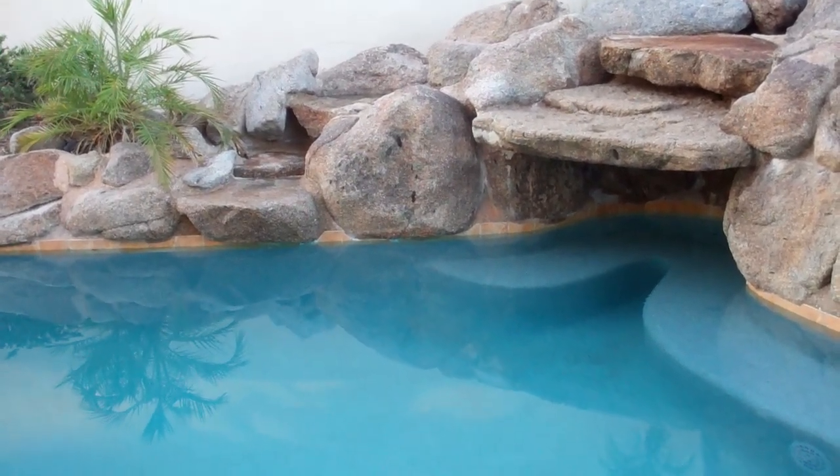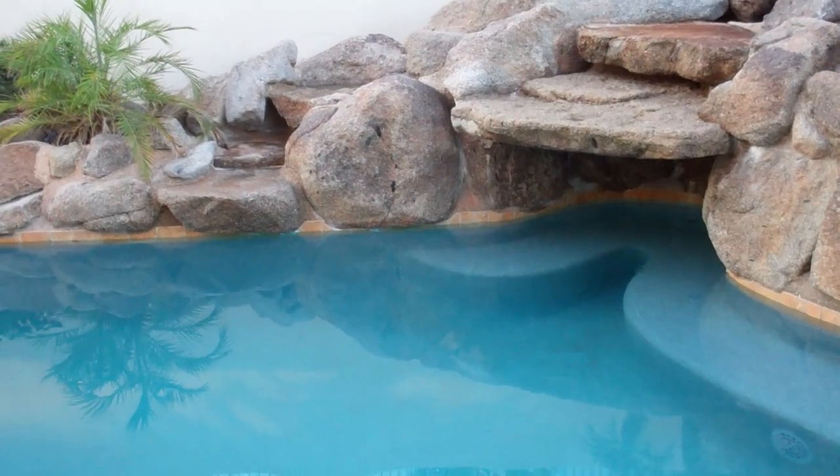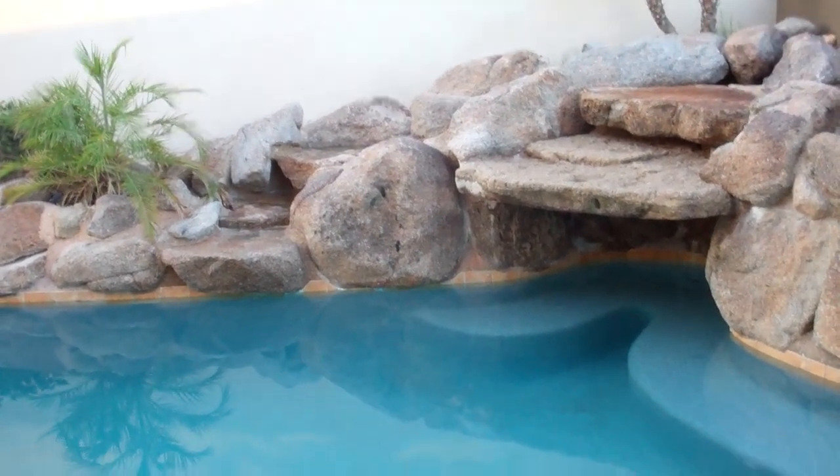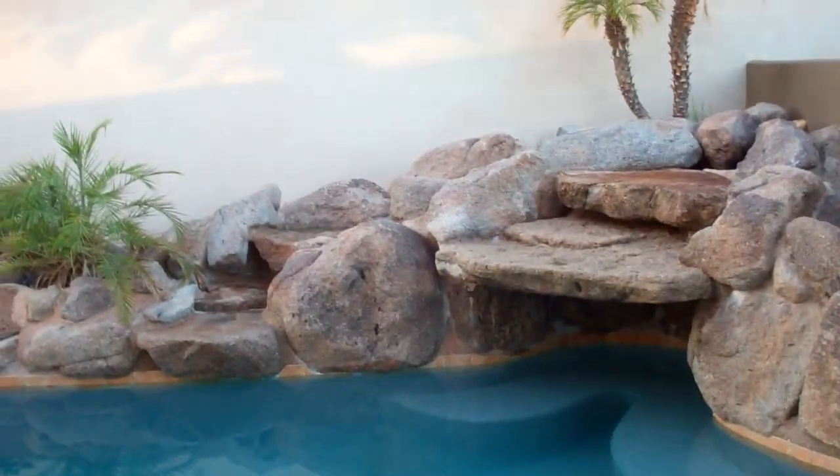So what can you do to get rid of that white stuff? It has to be taken off by sand blasting — you have to chisel it off, it's a rock. There's an Excalibur machine that hooks on the side of the pool and it glass-bead blasts your tile without damaging it, and blasts that mineral off. How do you keep it from collecting like that? You keep your pH down by adding acid to your water — keep it where it's supposed to be: 7.2 to 7.4 on a pebble tech, 7.4 to 7.6 on a plastered pool. Keep it down there and you will never have that stuff building up.